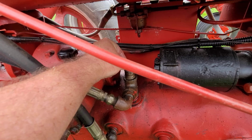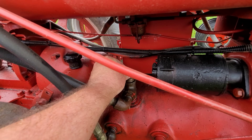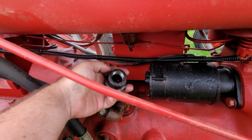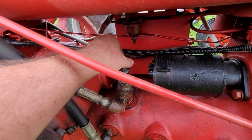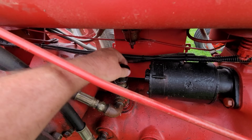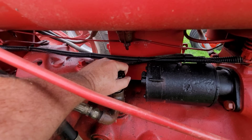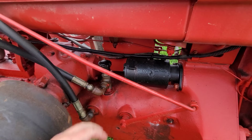You just want to gently put that back in there. The dipstick on the M is different — it hangs from a chain and goes down — but this one's nice. You can see the 'full' and 'minimum' marks right in there. I like to be a little more on the full side than the minimum side. Tighten that down and there you go.